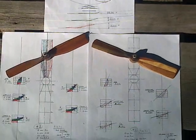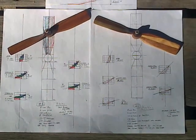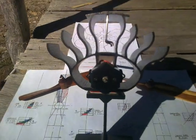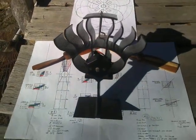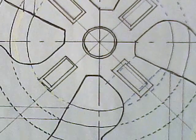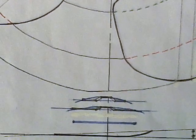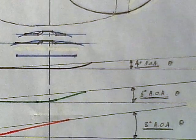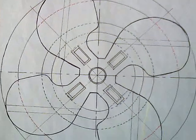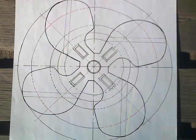With the first video in the third attempt to make a laminated helical pitch wooden propeller with which to adorn the electric motor run by the Peltier effect device. As explained in previous videos, this thing not only has reverse helical pitch, it's got negative camber on the inside half of the radius. So it shears the air in two different directions at several different air speeds and wastes a lot of power.